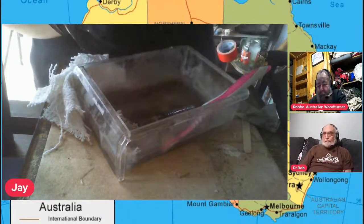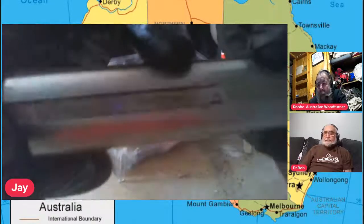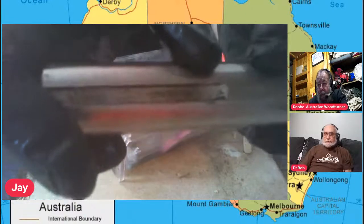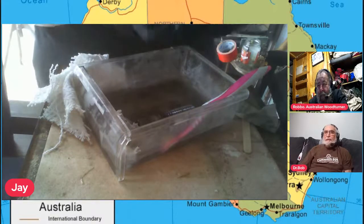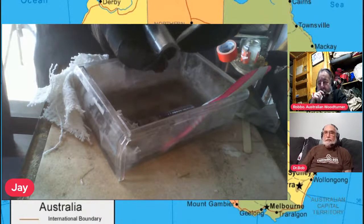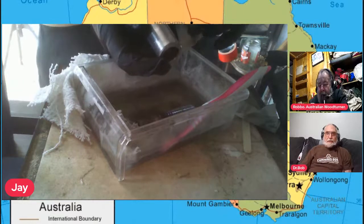Also, I don't know how these ones got in there, but there's actually notches, like two down here, one either side. That's caused by your spindle lock. It's where you loosened it right off and allowed it to slip over the top of it. So you want me to try and sand that back a bit too? Yeah, just sand them back a bit too.